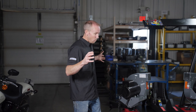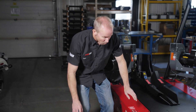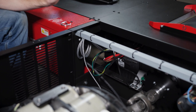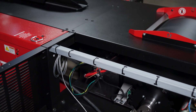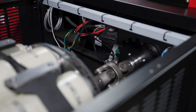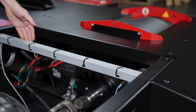To keep this dyno healthy and in good operational condition, first let's talk about the battery. The battery is used for the starter and operating the power carriage. Make sure your battery is well charged. If you go through a season where you don't use your dyno much, we recommend putting a battery tender on it. Also keep in mind that batteries contain sulfuric acid, so be careful when installing or removing them.